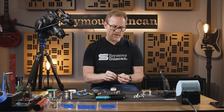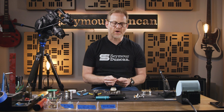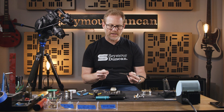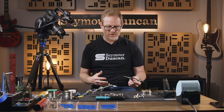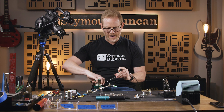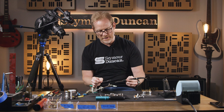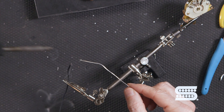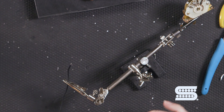Cloth wire is a little harder to tell, so try to get a variety of wire to practice on. Practice tinning them and making sure everything is clean and that the solder is flowing through the wire. The helping hands tool is a great practice aid — you can attach a lead wire to it and practice tinning. I'm going to heat this element up, heat one side, and try to get it to flow nicely across. You don't need a lot of solder when you're tinning wires.